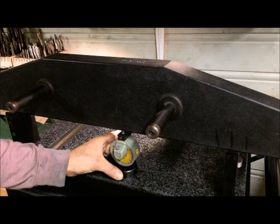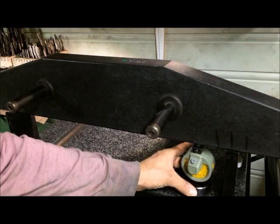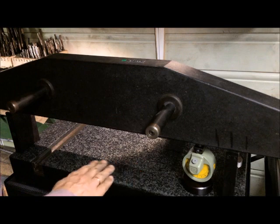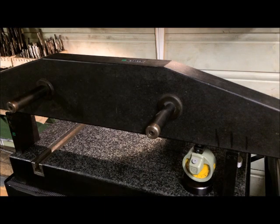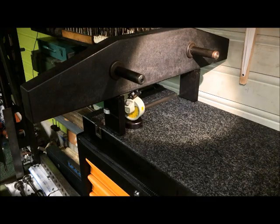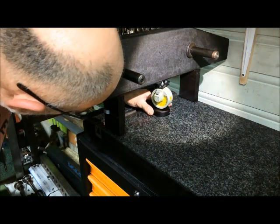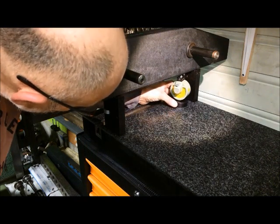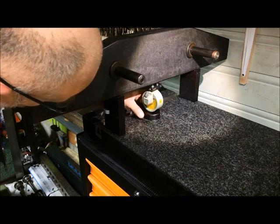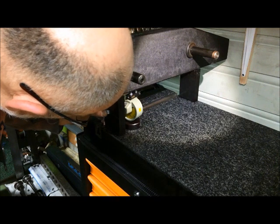Here I see it's three microns — so we are up to three microns, which is way better than I thought. Taking the reading from the other angle, 90 degrees to that, I find I have zero it there, between — not entirely but almost. We have to repeat that again and adjust this a little bit more.